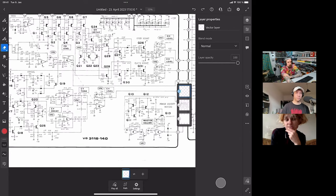Yeah, maybe. I think the most interesting difference between the diode ladder filter that I did and the Moog filter is the way that the feedback is applied to get the resonance. You know how the Moog filter loses low end when you turn up the resonance, right? That's kind of infamous behavior. My filter doesn't do it, because I just copied the way that I do resonance from the Korg MS20 filter, which does it in a specific way that doesn't kill the low end. That's going to be interesting to compare, definitely.